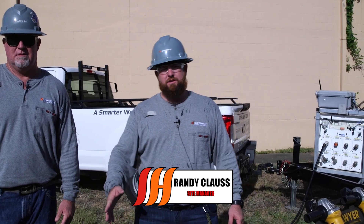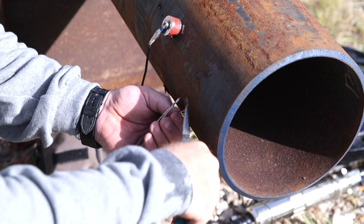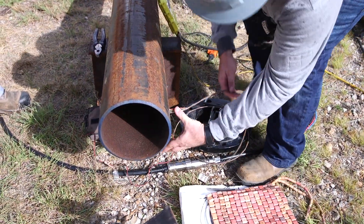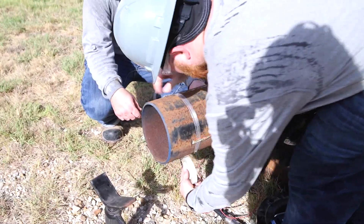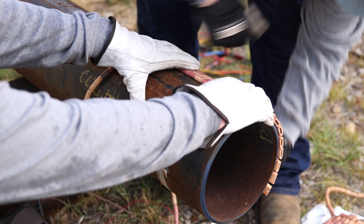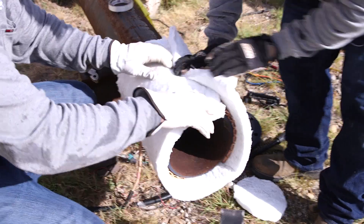What we're gonna do here is a bakeout, also known as a degas. This is an existing line. What we usually do is come in and do a bakeout — we're gonna wrap all this stuff up onto it. Pretty much the reason for doing this is these existing lines have a lot of hydrocarbons that go through when they're feeding product through, and that leaves impurities into the metal. So what we're gonna do is wrap everything up, and the whole reason behind that is it's gonna help remove any hydrocarbons that are left in the metal.